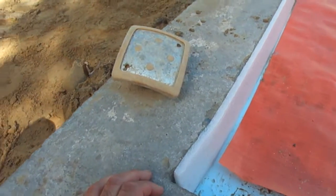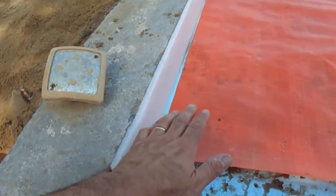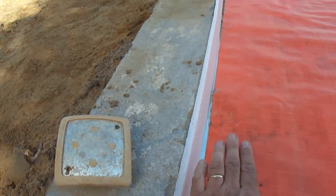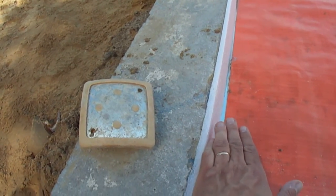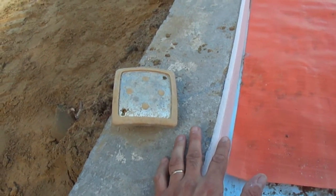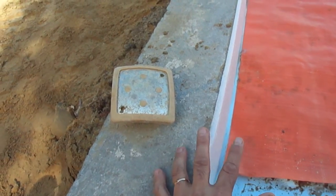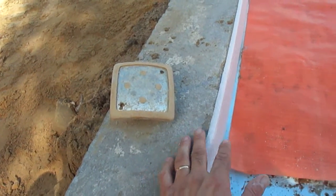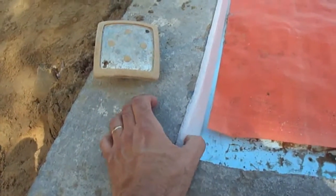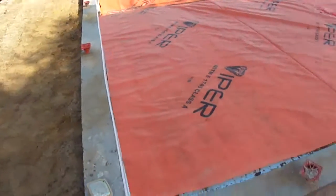Here's a close-up. You've got our concrete foundation wall, and down in here is where we're going to put our slab. When the slab gets poured, it'll abut up to this piece of tearaway foam so that there's always a gap between the wall and the slab. Anytime there's any adjustment between the two materials, this foam will either shrink or compress so there won't be any force or damage from pushing against each other.